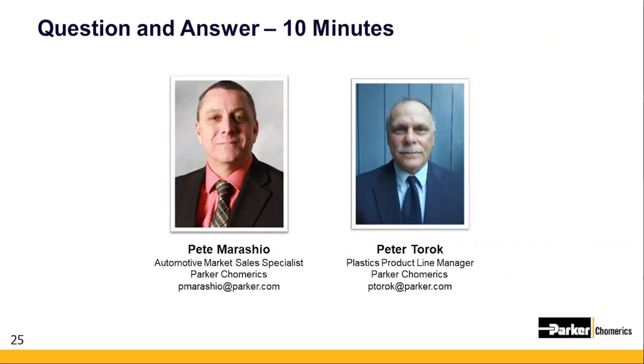There's one here about our thermal products. What dispense thermal management material would you recommend on that same 77 gigahertz radar sensor application that would best dissipate heat? Obviously, there's a lot of thermal requirements that we'd want to look into, but I would typically lead with our 3 watt per meter K systems, and depending upon the need, we might look at the higher performance 7.5 watt per meter K systems. My typical go-to tends to be our gel 30 or gel 37 materials. And then the high-end solution would be the gel 75.